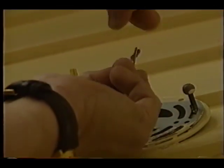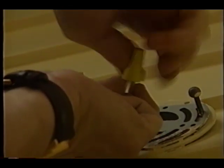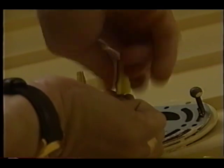Remember to put the wires together correctly. Attach the white wire of the fixture to the white wire that's in the box, and the same thing with the black wire. And don't forget the ground wire — it's very important. Attach it to the bare copper wire that's in the electrical box.